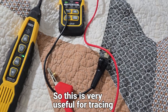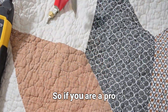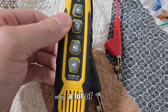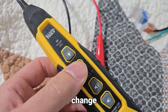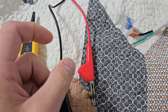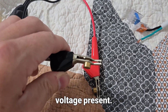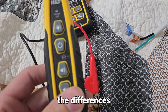This is very useful for tracing shorted circuits. This is the more advanced section of the video — for pros, handymen, or advanced DIYers. The reason why a lot of professionals like to leave the power on is because we know there's an instant change when we make a change. If we leave the power on and start shaking a receptacle and the light flickers, we know we made a change and it's a good indication we're on the right path.